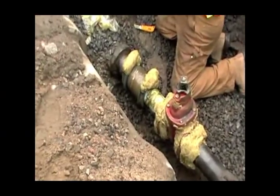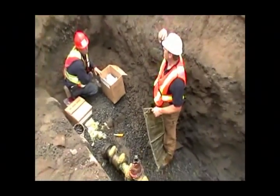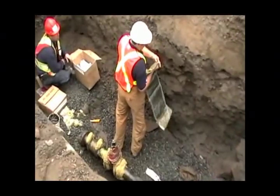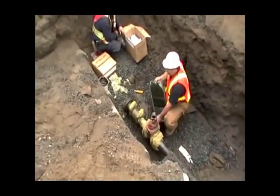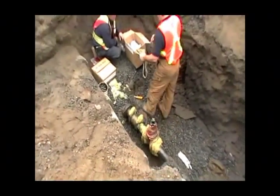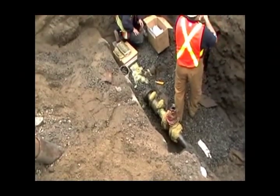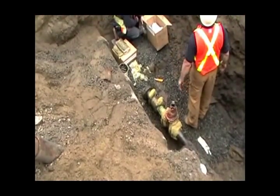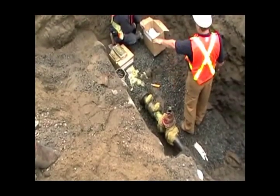So now, say you were doing some bigger diameter, say 12 inch and up flange joints. To profile, you can use this mastic blanket, which has a fabric side and a mastic side, which is down. This would be wrapped around those flanges, much like a diaper. It's brought around and then it's kneaded around the nut and bolt just to smooth off. It's really typically used as a time saver for those bigger diameters. The small diameter stuff like this, I find the profiling mastic just easy to break off, cut off, and pack in. So you're suggesting 12 inch and up, perhaps, using this? You can use that mastic blanket as a profiling material, as opposed to the profiling mastic, that's correct. And that's strictly as a time saver.